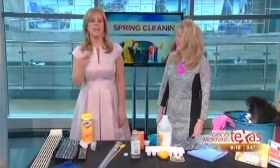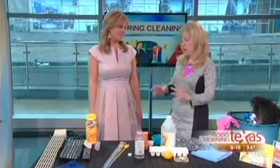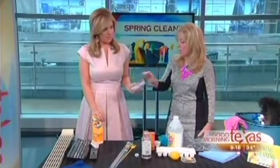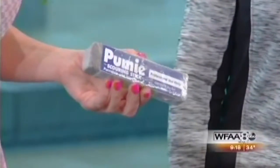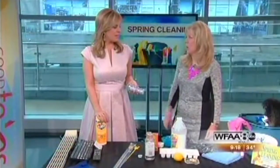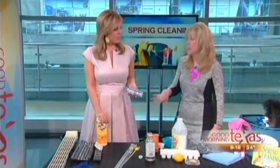How about that hard water ring in the toilet bowl? That's lime scale — a nasty gray ring that seems like no amount of scrubbing will remove. You need a pumice stone, which you can get at any hardware store very cheaply. Scrub on that ring and it will come right out. The pumice stone is best used inside the toilet bowl or wherever you have heavy hard water buildup, and make sure you have plenty of water.